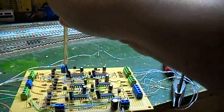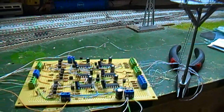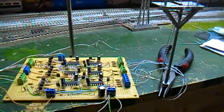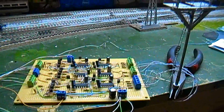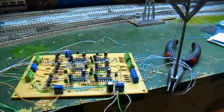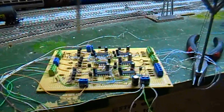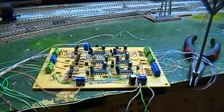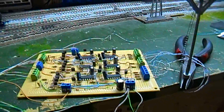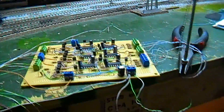These connections here are a special jumper connection to either make the green aspect flash or remain steady. There is a built-in flasher on this board that allows the green aspect to flash or be steady. Doing some research on CPL aspects, a flashing green with no marker light would be like a slow clear. There will be a situation on the part of the layout where this signal is going to be installed where I will need a steady green and a flashing green, depending on how the switches and block detectors are set up.